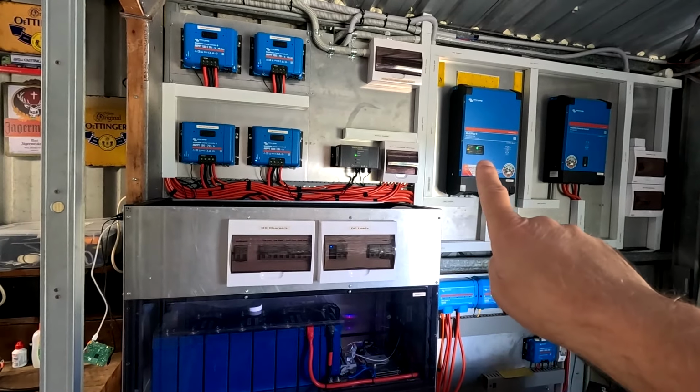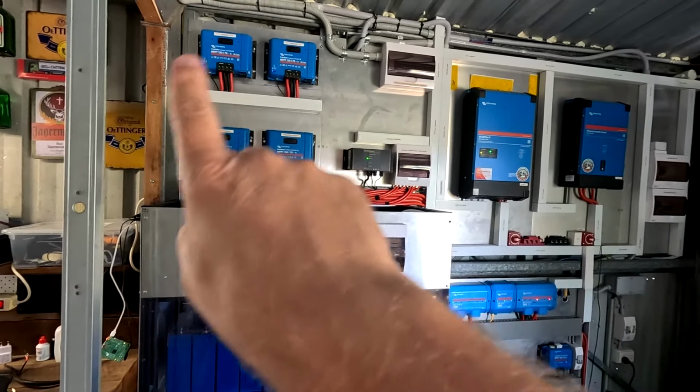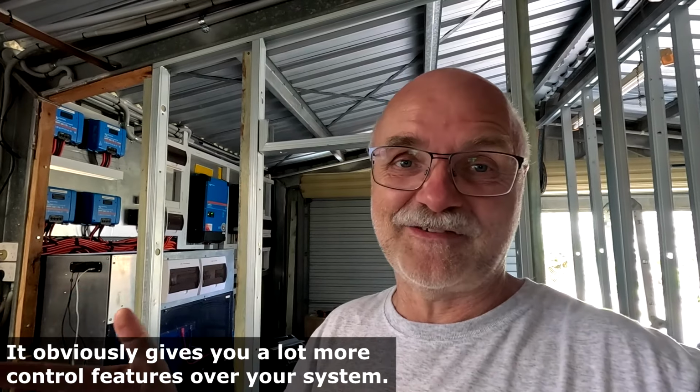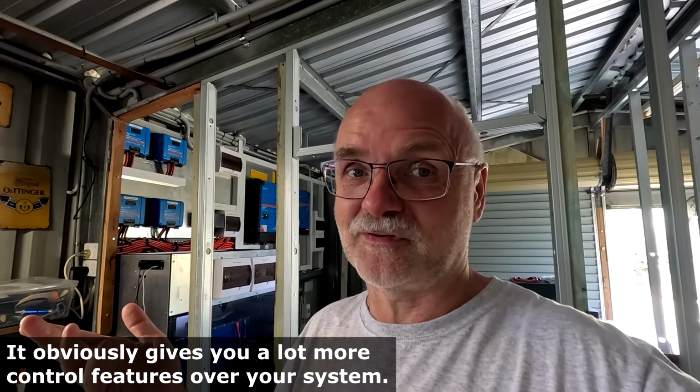As long as we are not under the shut-off voltage of the inverter, everything keeps running and even charging during the day. So the GX device, either the Cerbo or the Raspberry Pi with the Venus OS running, is only a nice to have feature. It is not a necessity to keep your system running, thankfully. But again, with communication established, everything would have shut down.